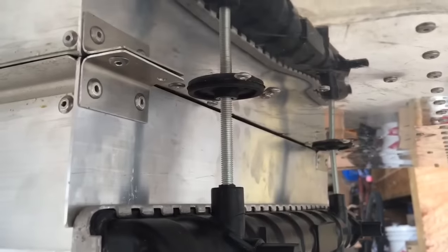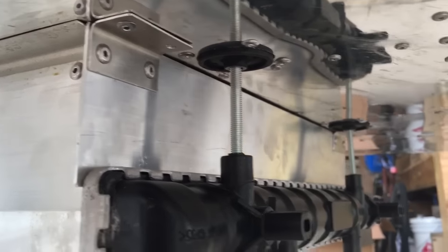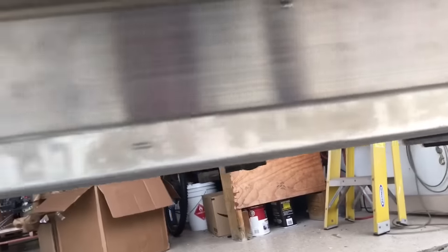The back of the radiator — I just ordered some 1/16-inch by 2.5-inch tall aluminum strips from McMaster and did the same thing on the front. I actually got a little bit of a real thin angle up in here too, and didn't use a lot of rivets — basically had two rivets holding it to the airplane, just so we don't drill a bunch of holes. They're number five rivets, so they're pretty strong.